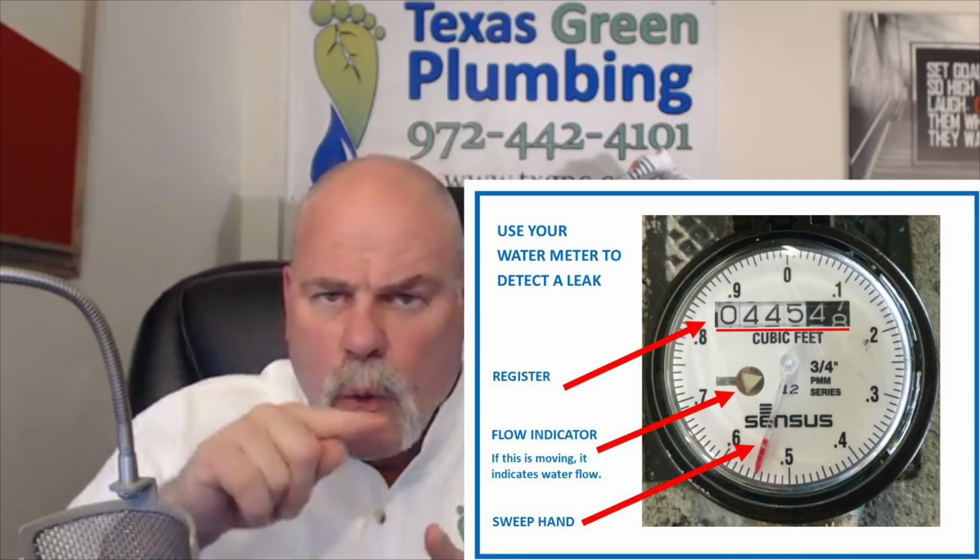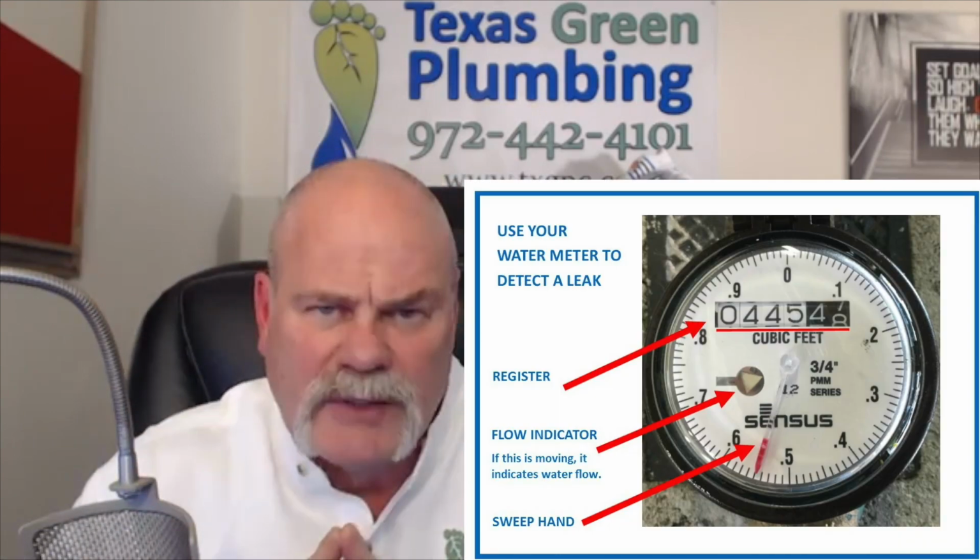So what you need to look at as a homeowner and the things you need to understand is how that meter works. Watch the dial turn. Watch the big arrow indicator that slowly spins around. One thing that I really like to do is get a 5-gallon bucket, hook it up, and turn on the water and watch it, and watch how many times that little low flow indicator spins, and watch how far that big one moves. The big one may not move very far, depending on if you have 1 0 or 2 zeros, and also, is your meter reading gallons or is your meter reading cubic feet? I think most of them around here these days read gallons, but it's a good thing to look at, know, and understand to make sure that you know what it is you're looking at.